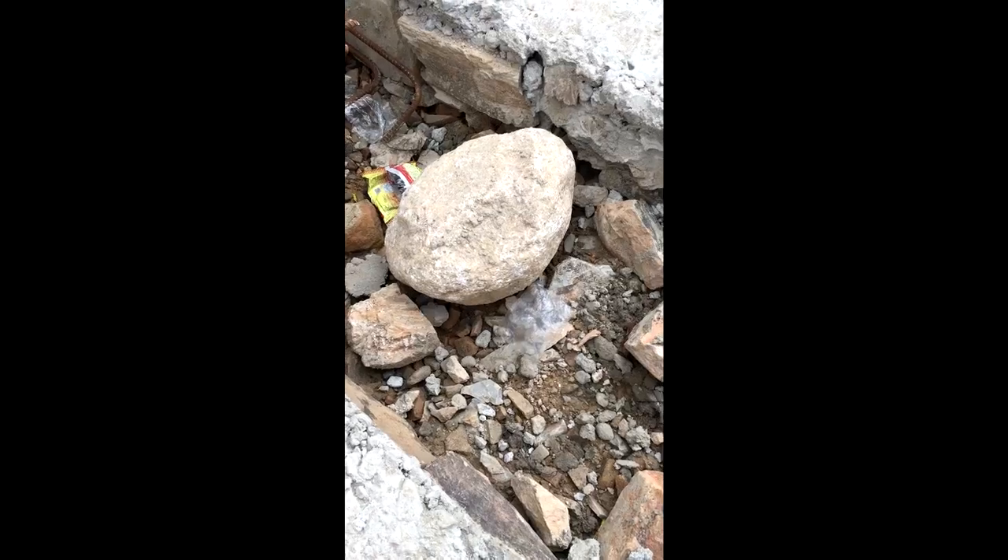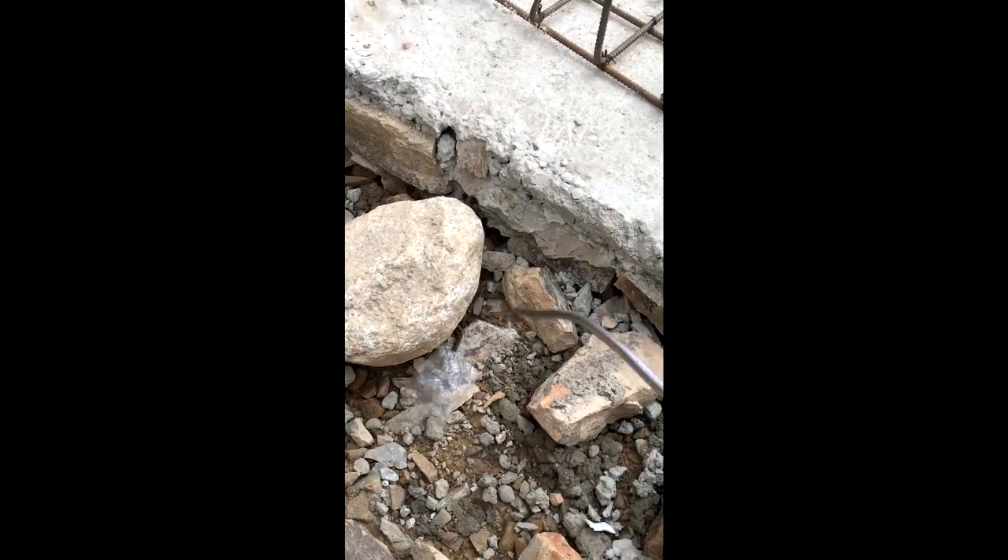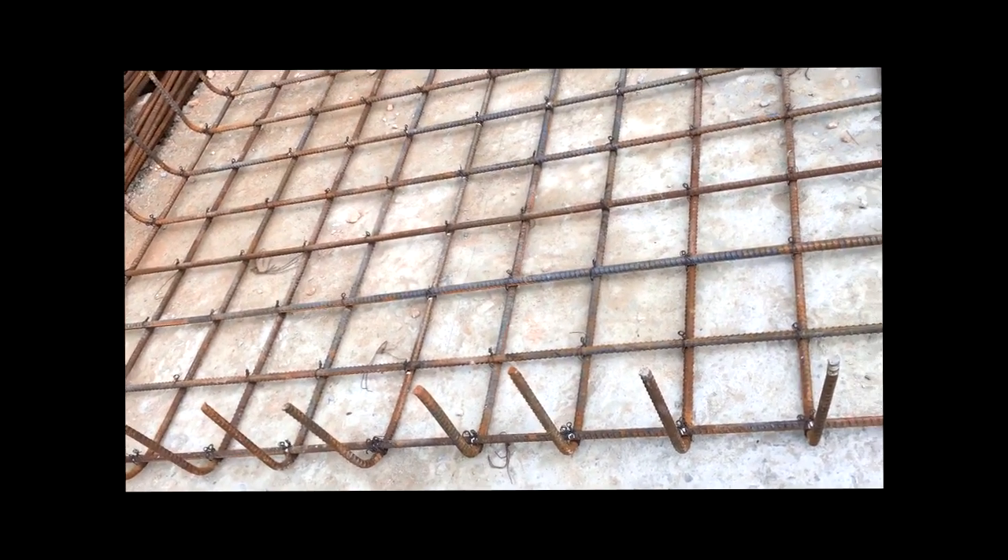I'm at the site now. As you can see, there is the compacted earth, then 150mm stone soling, above it 75mm PCC, and above the PCC the bars have been placed. This is an isolated footing; however, the process is the same for both isolated footings as well as shear wall footings.